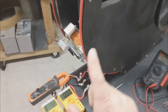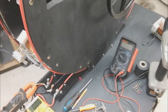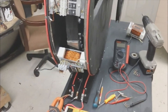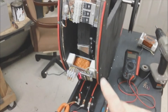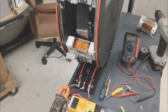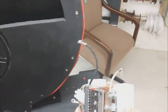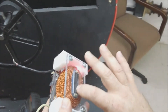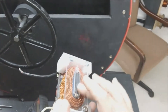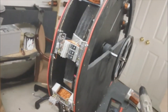On the high amp issue, I tried the keys from the cart motor — the ones I knew would work — and they were actually lower resistance, which didn't make a lot of sense. It panned out that dropping the resistance increased the amperage, not decreased it, but I had to test it anyway. One of the coils had plates starting to come out, so I had to put super glue on it — that's what I did on the small box motor and it worked just fine. So I may need to check them all, but basically at this point I believe the issue is the spacing on the magnets.